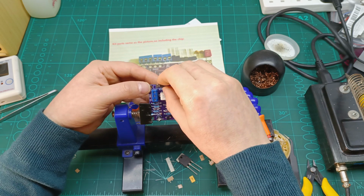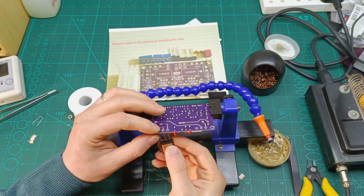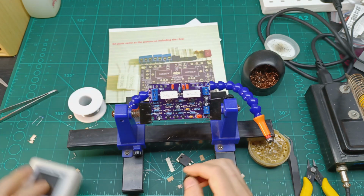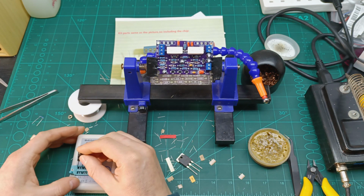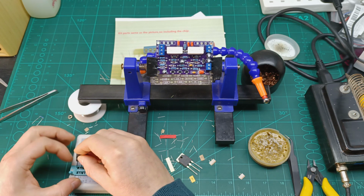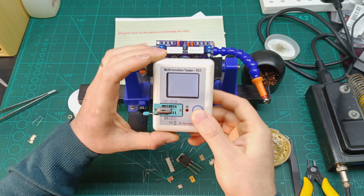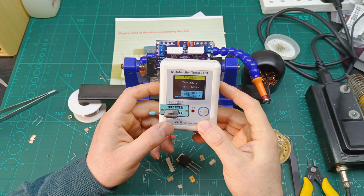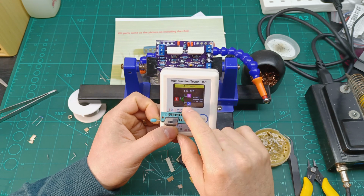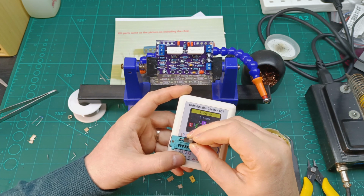So I'm going to solder them a bit raised up from the PCB board, in order to make sure that the C is C, because it's PNP. Let's also test them to make sure they are correct. So if I put them in over here, I should have them in the right position. Okay, let's have a look. It should be a PNP, the C. No, the C is NPN, the A is PNP. Yeah, so this one is NPN, and the A should be the PNP transistor.